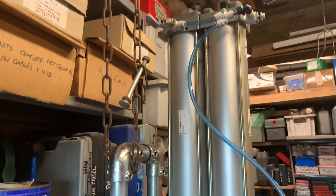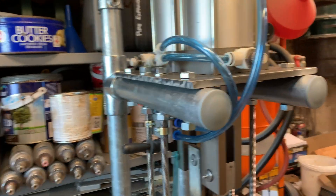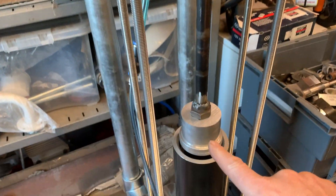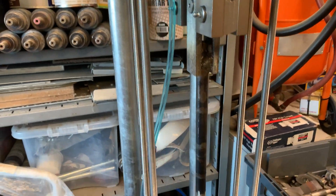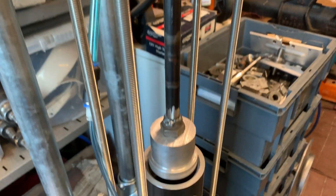The monster's taking shape — it's about seven foot high and too heavy for me to move on my own, so I need some help with that. Still waiting for a few parts, and this 12mm steel plate and the one down here needs to be painted because there's going to be a lot of water sloshing around — when you compress the card you squeeze the water out of it. The actuator here is only a two-position one — piston down, piston up. I may want an in-between position, so on this side I'm going to add basically an on/off switch to the air supply to this actuator. That's not turned up yet so I can't show you that working, but I can show you the two pneumatic cylinders and the cross beam going across into the pot.